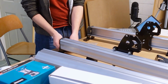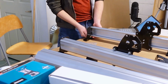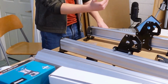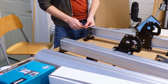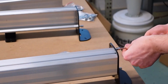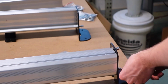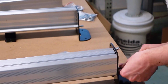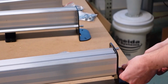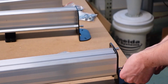And these are going to be another set of bolts that will take a little longer to put in, but we really wanted to make sure that the feet and the rail could be very securely attached to each other by giving a lot of thread length for the bolt to grab onto. You'd be surprised actually that because of how aluminum is, it can sometimes be a little on the soft side, and the threading can kind of cross thread or wear out. That's something actually you want to be mindful of when you're putting these bolts on.